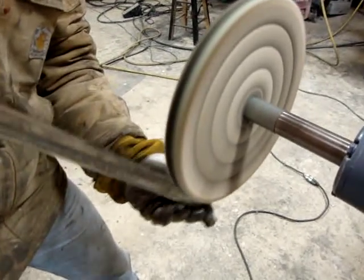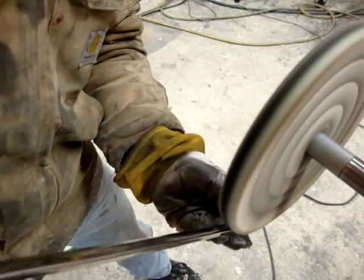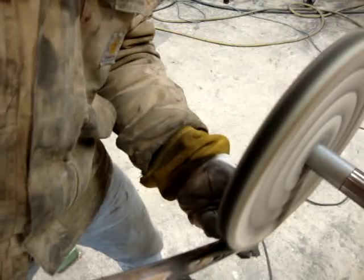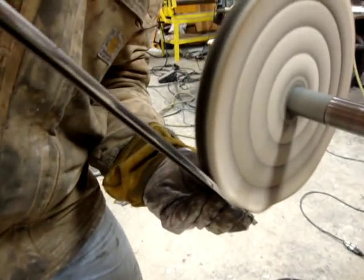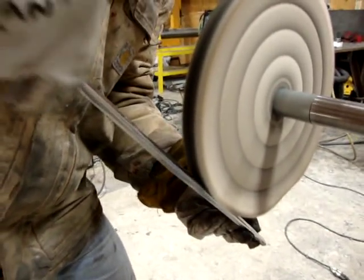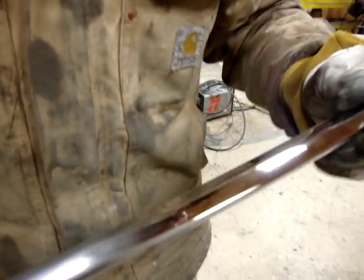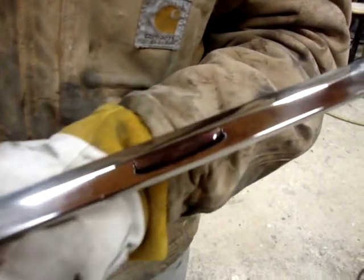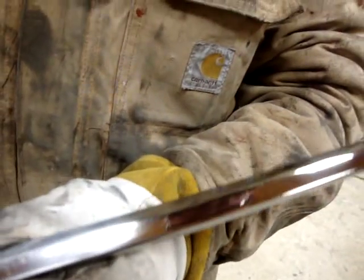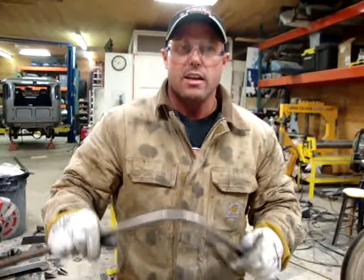Also remember, if your outside edge is shown, go ahead and polish that too. So now you can see that's basically a mirror finish on stainless that started out looking rough. Hopefully that's showing up on camera. You can pretty much take any piece of stainless, bump it out, sand it out, file it out, and do everything necessary to save it.